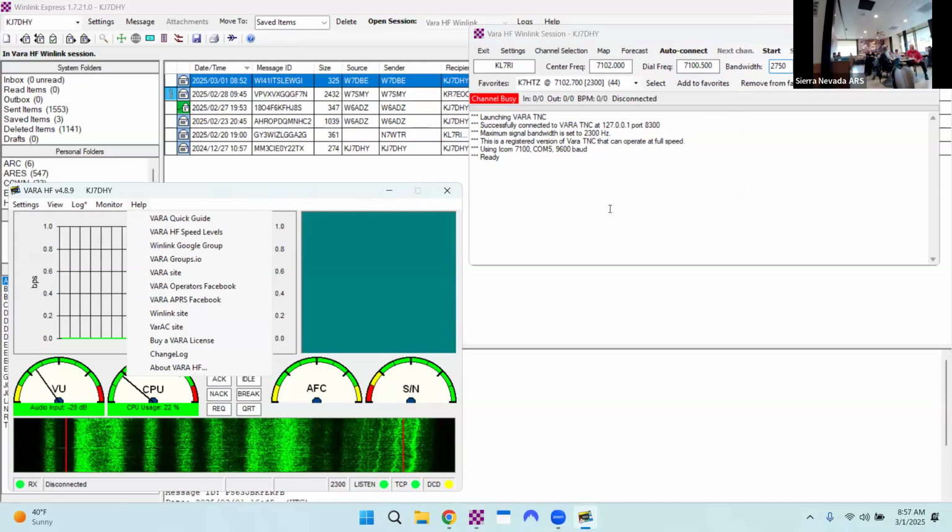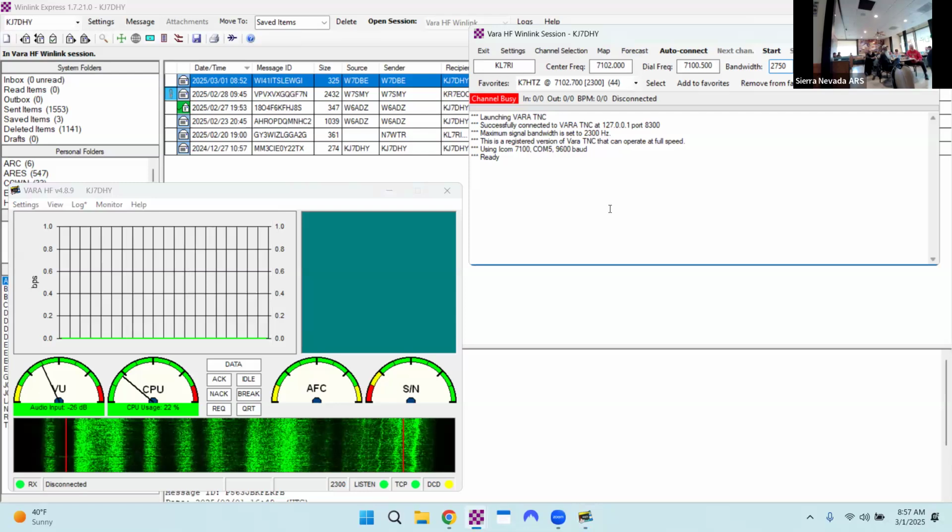Okay, I just want to make a comment. Yeah, just real quick, the baud rate initially on the default is like 9600, and it won't transmit the audio to the radio or work the PTT. So I changed it to 38400, or Eric did, and it worked fine. So you've got to check that baud rate on the default setting for the transmitter, because 9600 wasn't good enough for my Yaesu, so it had to be higher.